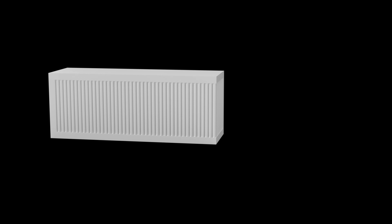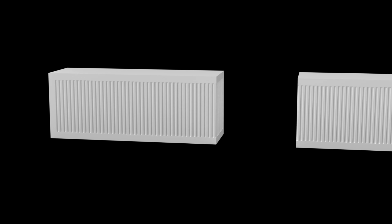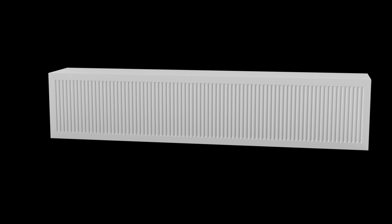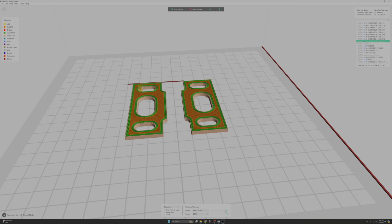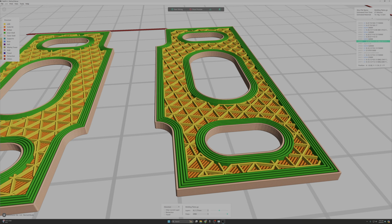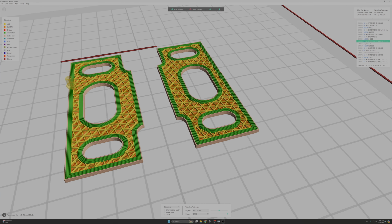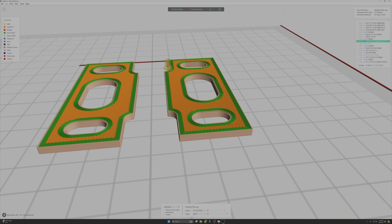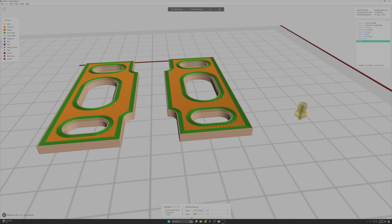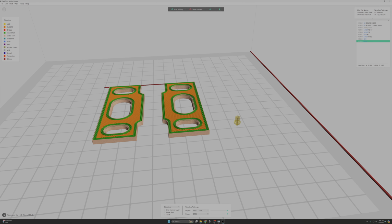So when we are welding a 3D printed part, we are not necessarily trying to get full penetration throughout the structure, but just welding the two shell pieces into one to accommodate a load path. Ideally, we will be welding two parts together that have walls on the surfaces to be welded. In this case, the infill will already be bonded to the walls that are welded. So if shear and tensile stresses are expected on the joint, leaving in the walls when 3D printing the parts is ideal, because this will help facilitate a 100% penetration weld.